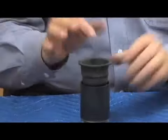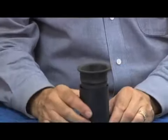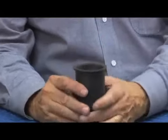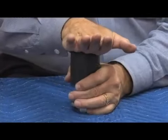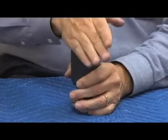So I'm going to use the properties of this O-ring to help me fold this rolling diaphragm into the retainer. So what I'm going to do is back this support back up against that O-ring. And by placing it up against it, I'm going to take my hand, cup it like this, and make sure, move it all the way around 360 degrees, that I'm pushing down on that O-ring so it's sealing on the top. I've trapped the air in this upper portion at this point.